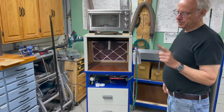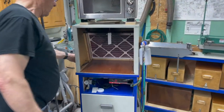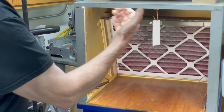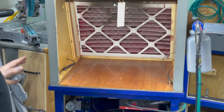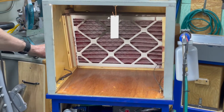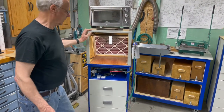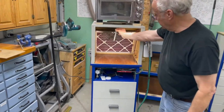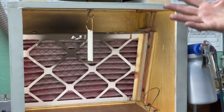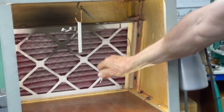Because it's dust and not paint, I have the lights inside there. It's just a little strip of LED lights all the way around here, so I get light from all directions and it really works out good. There's a switch here for the fan. The part has to be grounded, so I've run a ground wire up here with a little brush. This hook up here is grounded, and if I have a part that's down below I just clip this clip lead on here and clip that to the part when it's on the lower turntable.